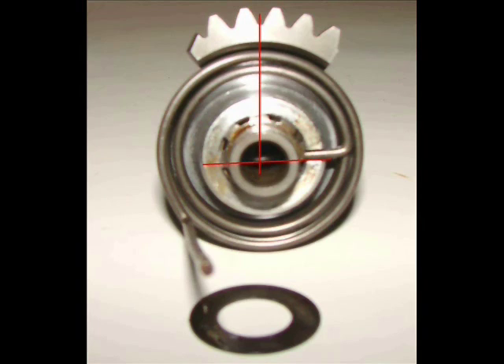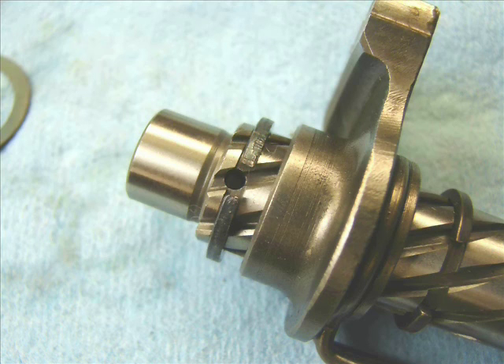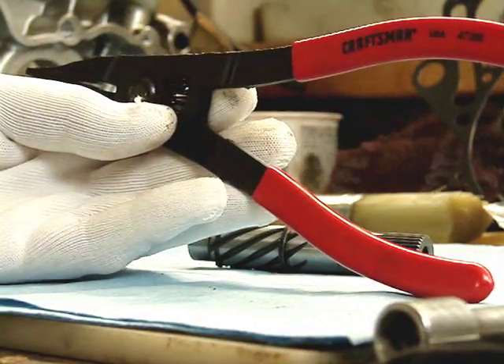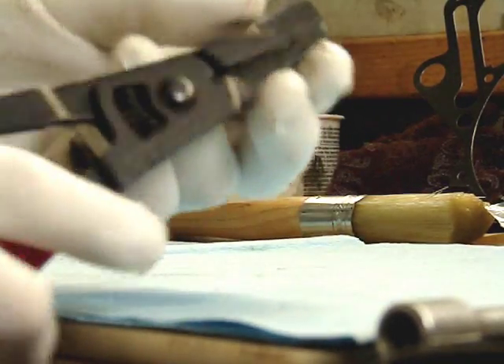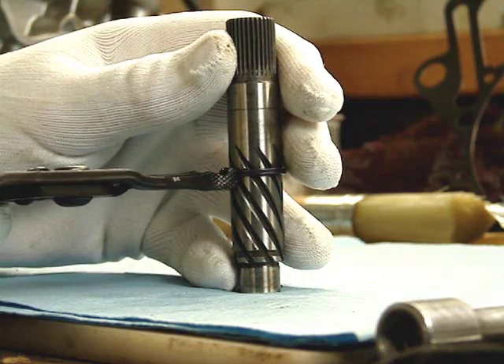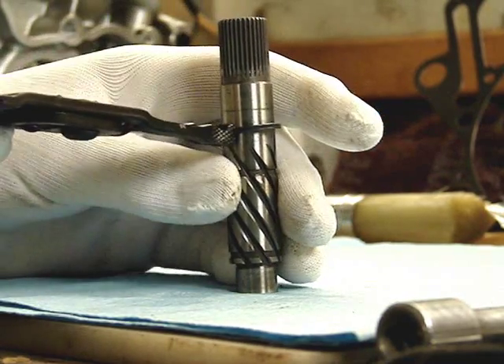This is the indexing — this is what it should look like when the gear is all the way in on the spline. According to the little spring, which has a part that goes through a hole in the shaft, you must align that clip with the hole. Then that notch in the aluminum bushing lines up with that clip and that hole. There's a special type of plier for these clips on the kickstart shaft. You just put this plier in the center of the clip opening and it spreads the clip. Don't open the clip too far because you'll bend it if you're planning on reusing it. Then you can get the clip off the shaft.